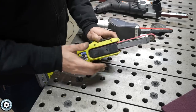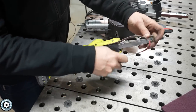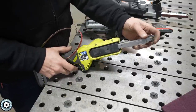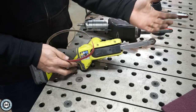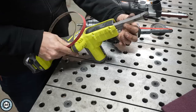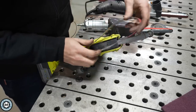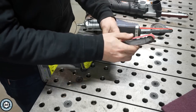To get the belt off one of these, there's usually a little quick latch that pulls the tool arm in. This one has a rubber contact wheel on it, which I really like because you get a little softness out of that. You can grind using the tip. These can often be used to grind out spot welds in an automotive application. I use the platen on this to finesse corners and do some grinding. The half by 18 belt comes off and goes back on super easy.